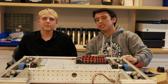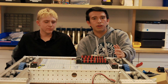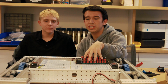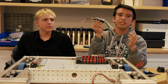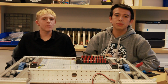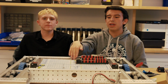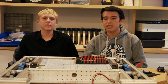As for the electronics, we've been setting up a layout here, mimicking how we can do connections on other robots. So far we'll have all the stuff that needs to be accessible during a competition on the top. As for other things like motor controllers, that stuff will go on the bottom where it can be more easily wired to the motors. As for other mechanisms that require electronics, we'll be keeping that more below because those don't need to be so accessible. That is pretty much it.